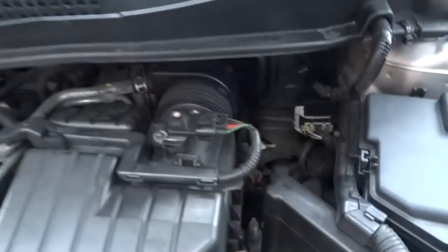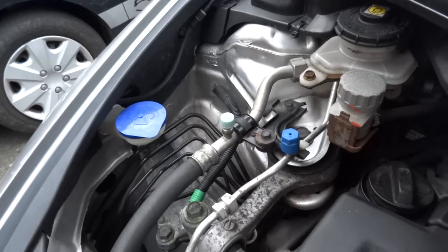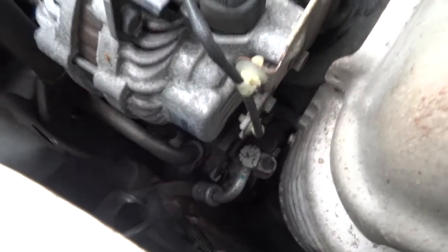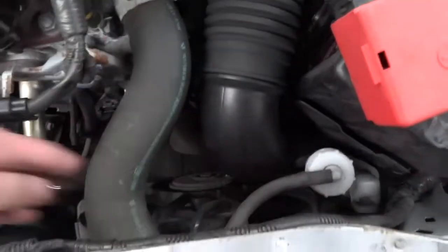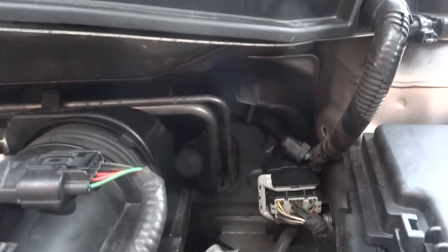So that's it, that's how they work. Here's your top up ports. Obviously the system being sealed is really important. Compressor's down there, it's got a bit of electrical stuff on it. Condenser, condenser fan for cooling it. Obviously the electrical side of it. The thermal expansion valve and the evaporator. And that's all there is to it.